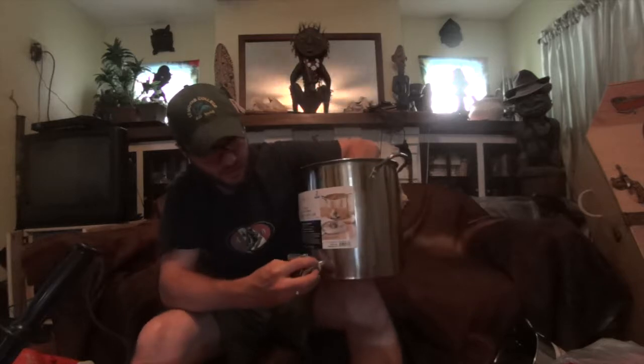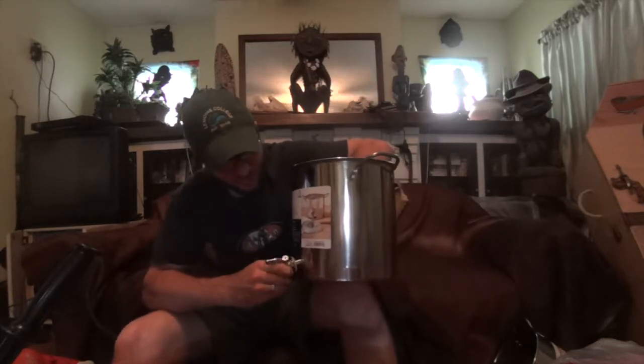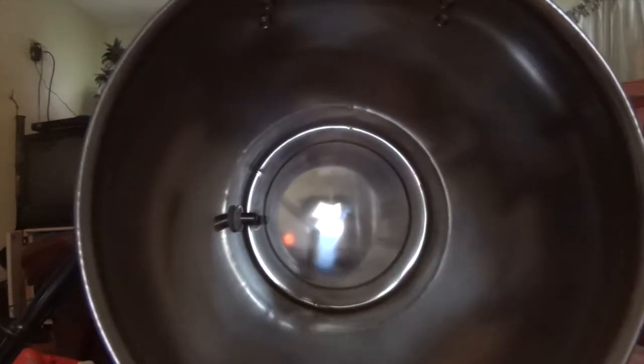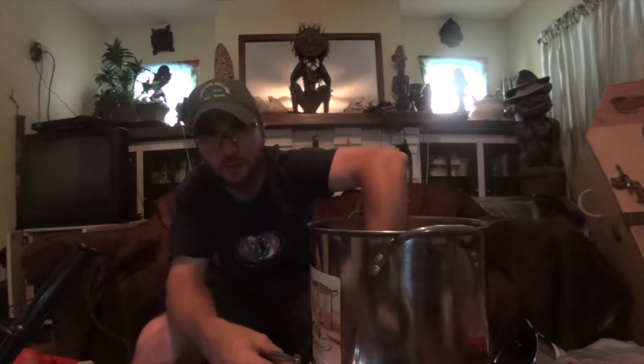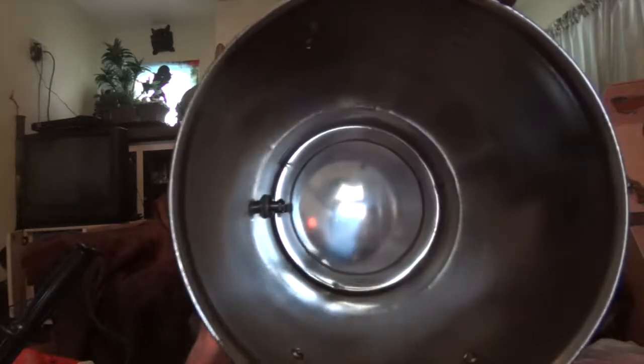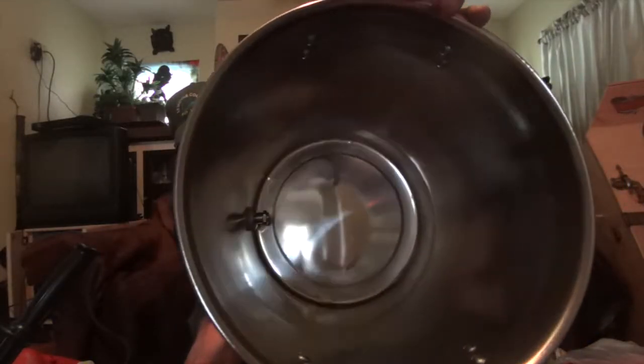Let's see if I can keep this up on camera. So all I'm doing, pushing through, getting that inside gasket in place. I'm going to hold this long enough so that you can see. One of my complaints about YouTube videos is they don't hold things long enough. Get that as close as you can. Put that secondary shiny cover up behind. And all you're doing is sandwiching rubber between metal. And if you do this right, you're watertight.